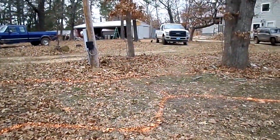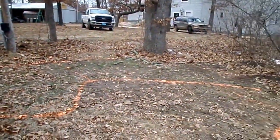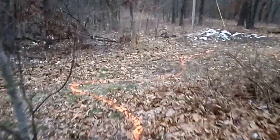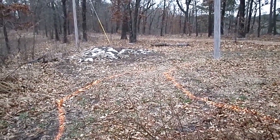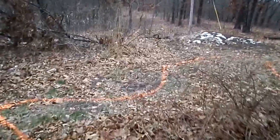What I did is I did my top contour line, I dropped down six inches with the gauge frame, and did another contour line. When I got over to the other side, the contour lines came back together a little closer, and I measured that — it was exactly six inches again on that side where the contour line came closer.